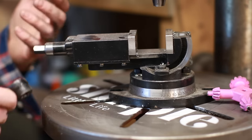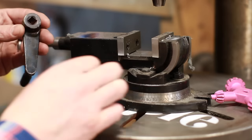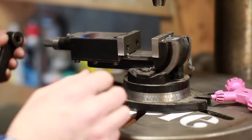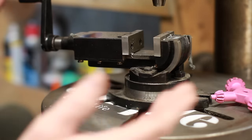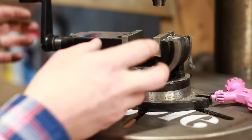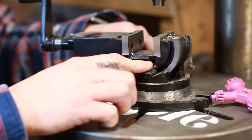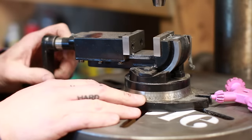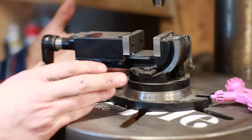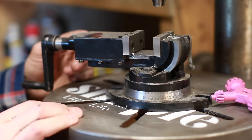This is another precision machinist vise. Some machinist vises have wrenches that come on and off — if you find these at garage sales, grab them. This one is also angle-adjustable, but it doesn't have a quick release; you loosen the bolts and swivel it to whatever angle you need. I don't use this vise a whole lot, but there are times when it's exactly what I need.